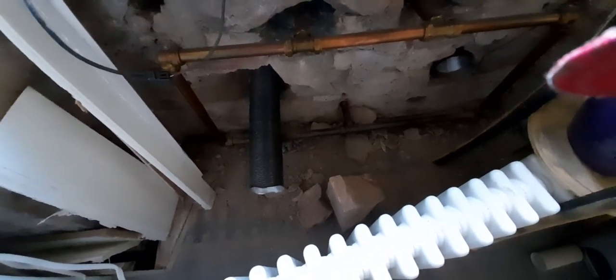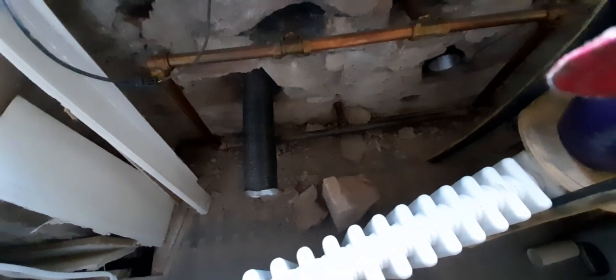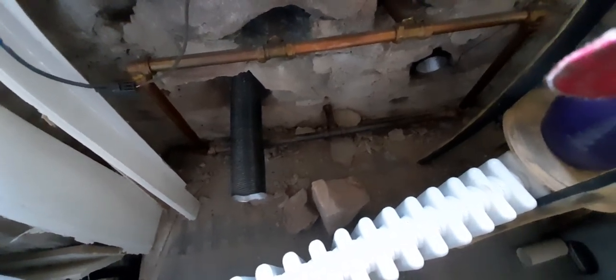Now this does make it noisier because you have both the air intake and outflow in the room. However, the other benefit of that is that it's pulling in warm air from the room. So it becomes more efficient, and more so if we use the thermostat, the thermometer on it, as you see. It will become more efficient because it's not using cold air from outside.